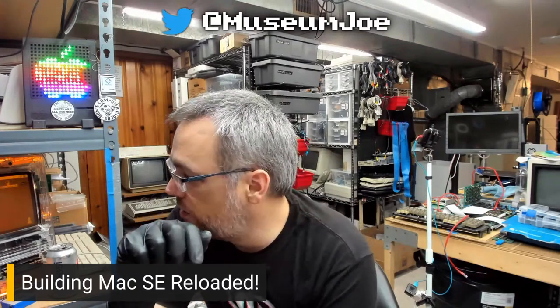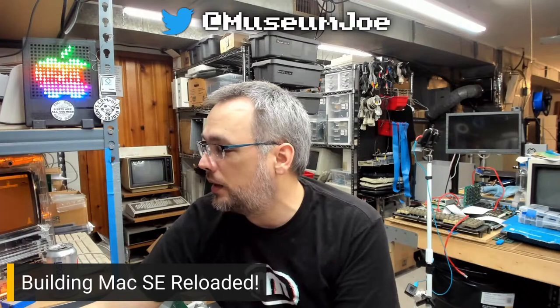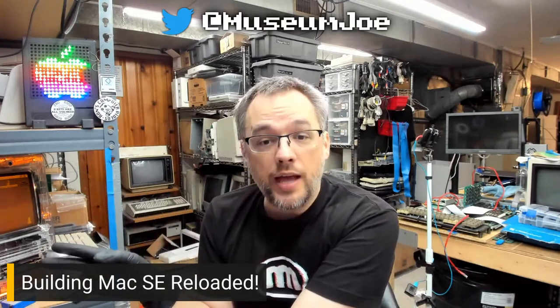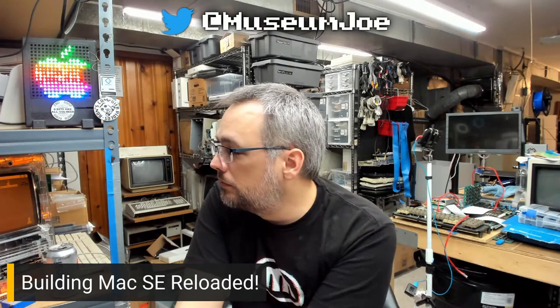Tech by Androda. The issue is that Windows throws a malfunctioning USB device error when I plug the blue pill in. Yes, Justin, there is a specific thing you need to do. Stand by. I might actually still have that here. You need to go to this website right here, get that tool, and install the driver that comes with that tool. That will solve your problem. Some blue pills have little glitchy issues with certain revisions of Windows. But you install that, it fixes that glitch, and then you'll be able to flash it, no problem. And if that doesn't work, send it to me and I'll flash it.